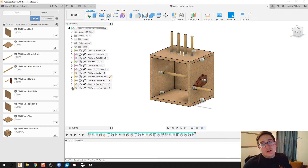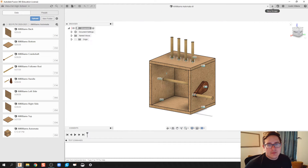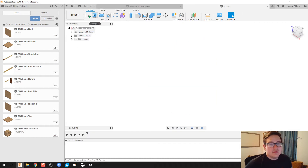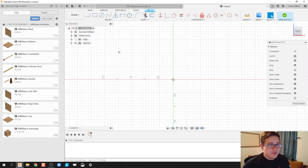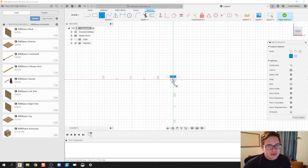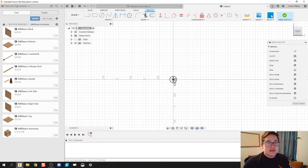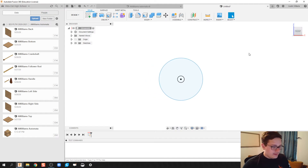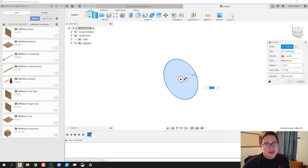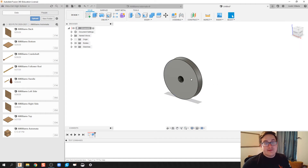If you need to figure out how to do the crankshaft joints with the follower rods, check out the next video. Since this is going to be a bottom-up design, I'm going to click on new design and then create a sketch. Our surface cam that we're going to do first is a circle cam. My inside diameter of the hole is going to be a quarter inch because that's the diameter of my crankshaft, and then let's do another outside circle for the outside diameter. I'm going to extrude this — we'll have a cam that has just a circle shape.